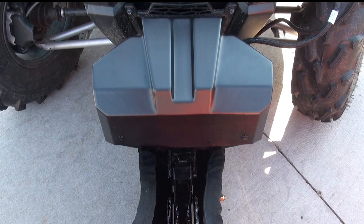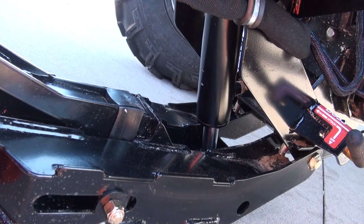Several of the components we use in this plow are common amongst other BOSS products, which minimizes the amount of specific parts you may need if repairs are necessary. Gone are the days of manually lifting or winching the plow into the raised position. The BOSS 5.6 VXT utilizes a hydraulic lift cylinder to raise, bringing it up to a full 30 degree lift height, making snow stacking a breeze.